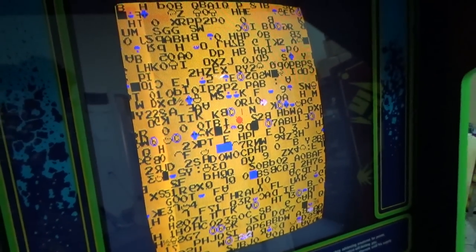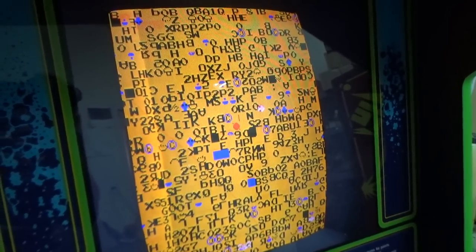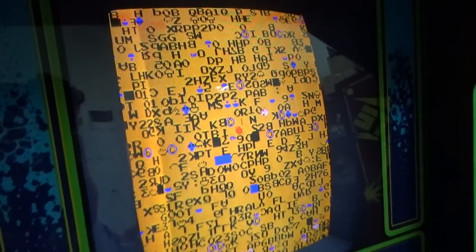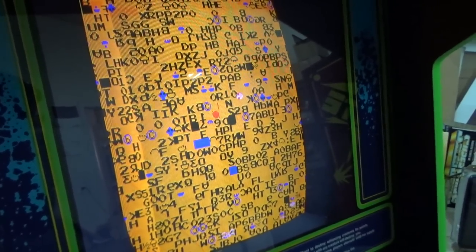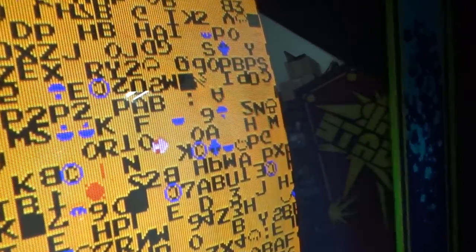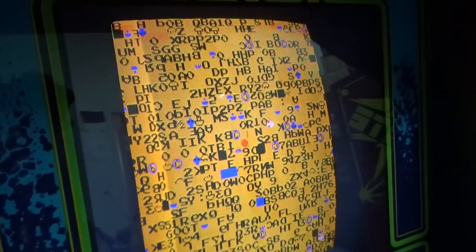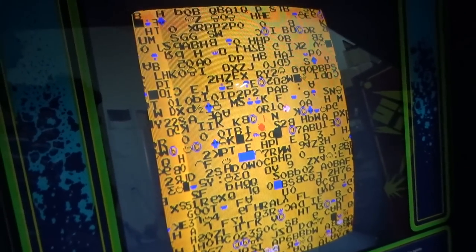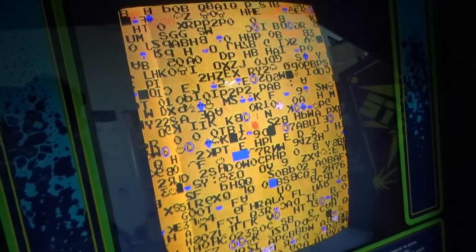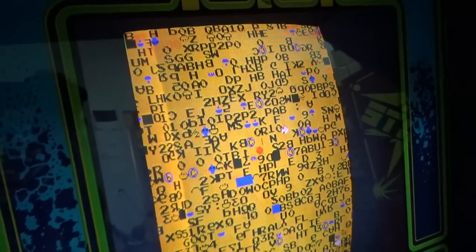So it's not just garbage all over the screen. Yeah, it's garbage, but it's not just random garbage. It's stuff that the game actually uses. So letters and little shooters and, there's a little piece of the centipede there and all of that. So it is accessing at least some kind of information. So what does that mean? Well, the clock is probably working, you know, or it wouldn't be able to read any of that information, or at least part of the clock's working.